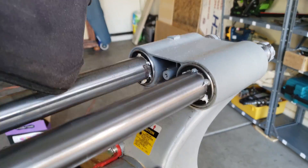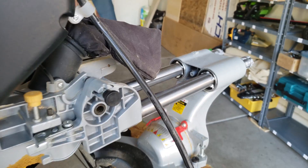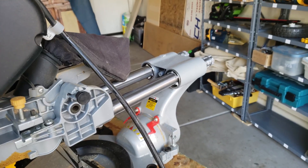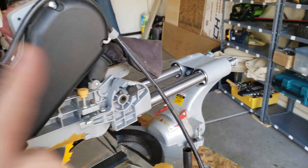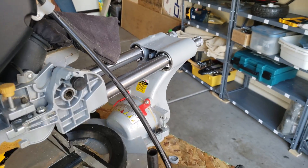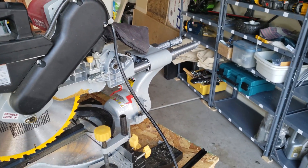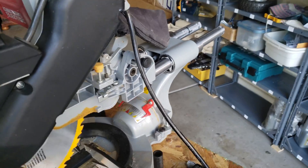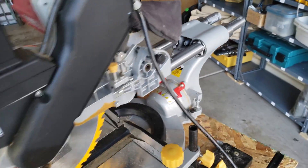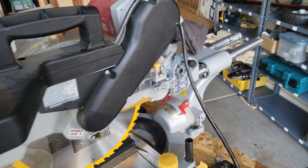One thing I noticed: if I put pressure down on the slide while sliding it, it's very stuck and almost bouncy. But if I lift up and make the pressure more equal, the sliding action is gorgeous. I think with those extra bearings in the rear there'll be more support to hold the weight of the saw head. I'm going to go ahead and install the rear bearings, grease them first this time. Alright, moment of truth — oh yes, so much better! Even pushing really hard down. Night and day difference, holy cow.